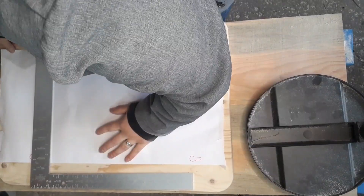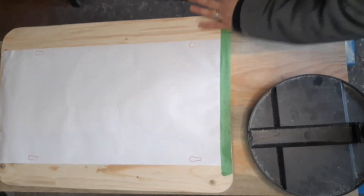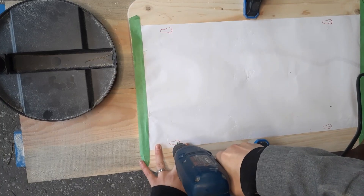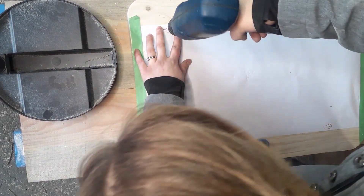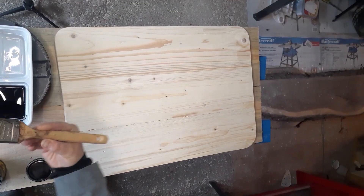To measure, I put a large paper over the filing cabinet lined up with the back and drew where the holes were for the screws. This is an easy way to make sure the holes line up without measuring. I make sure it's centered evenly and tape it down before I start pre-drilling. Pre-drilling helps to prevent the wood from splitting, which is especially important in a piece that's almost finished and has had a lot of time invested in it like this one.